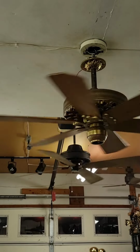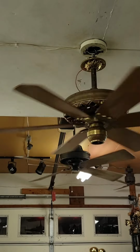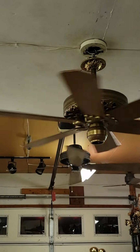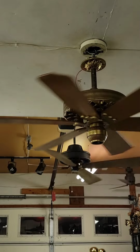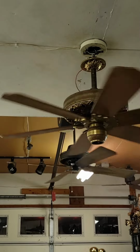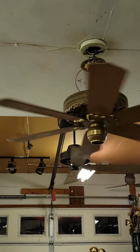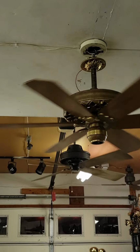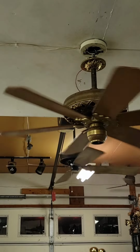Obviously, I can't swag or wire mold to there, and there's no attic access. So the control has to be on the fan somewhere, and there's no way. We need 2 smart controls, one for the motor and one for the light. And there's no room in that switch housing. The pull chain barely fits in there. There's no room in that motor housing. The windings barely fit in there.